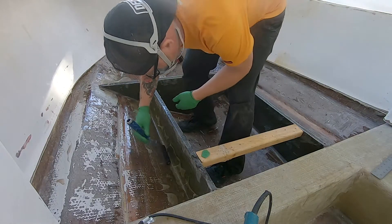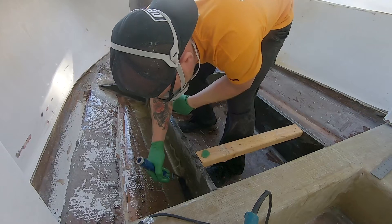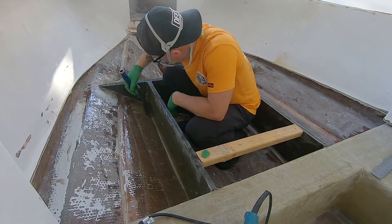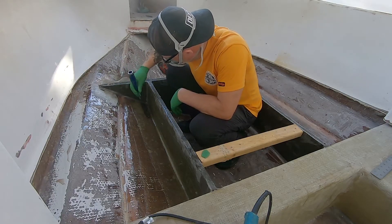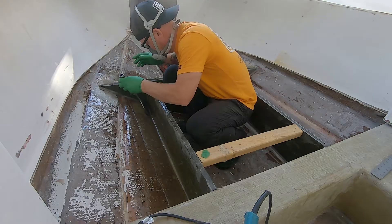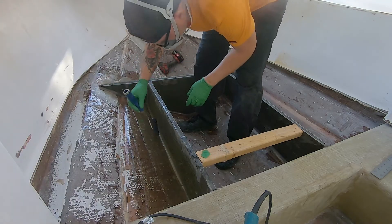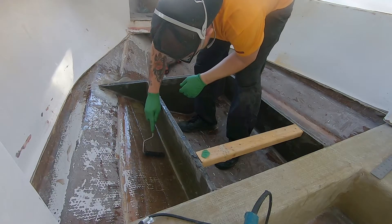Off camera I wet out the second piece of laminate. I'm taking the wet-out brush — the larger bristle brush — and rolling out all the air bubbles, trying to get it as smooth as possible. Then again coming in with my hands squeegeeing out any of the excess resin, and then I'll hit it again with the thin roller just as I did with the base layer. On this layer, as I mentioned earlier, I'm not using the same resin — the first layer was isophthalic, but at this point I'm just using a general purpose boatyard resin for the second and third layers. No need to spend the extra money on resin for those layers — all polyester resins are interchangeable and they won't interfere with each other.